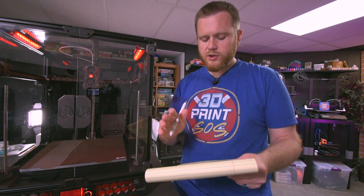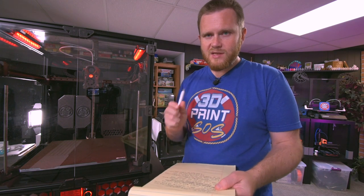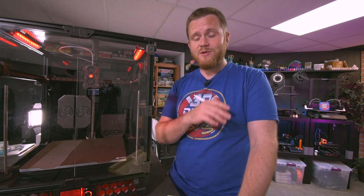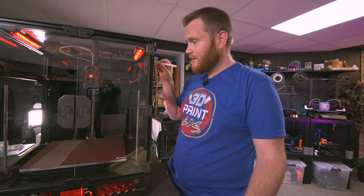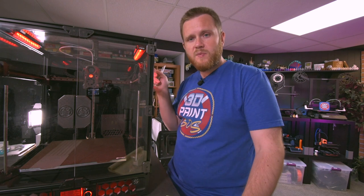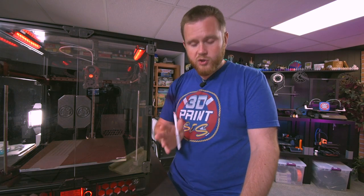The other thing is, I would purchase 100% either the toolhead PCBs, or the CAN bus or USB modules to reduce wiring. I would 100% do that. Fysetc themselves has one for $27 that comes with everything you need. It comes with pre-crimped wiring that helps you reduce the wiring that goes through the chains dramatically. And the maintenance becomes so much easier because on the tool head, if a fan breaks, you don't need to cut the wire and take the whole wire out. There's just a PCB on the side of your tool head. You just pop it off, change the fan, put it back on, and you're done. I would 100% do that, and I plan on doing that to this machine for longevity in case something else goes wrong. Maintenance would be just so much easier.